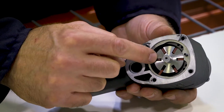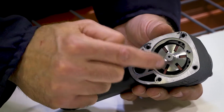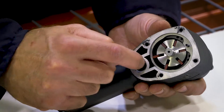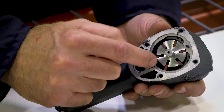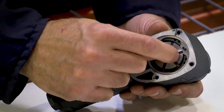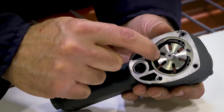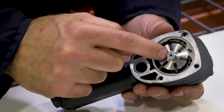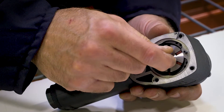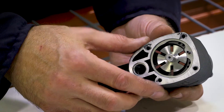Now we can see inside the gun and look at the actual air motor drum itself. As you can see by looking inside the drum, there are little vanes that drop down and up as the air motor spins by compressed air. These vanes can sometimes get full of sludge, corrosion, or any type of debris introduced with the compressed air, and they cause those vanes to stop sliding. Once the vanes stop sliding, the air motor won't turn because the vanes need to slide to collect the air to spin itself.